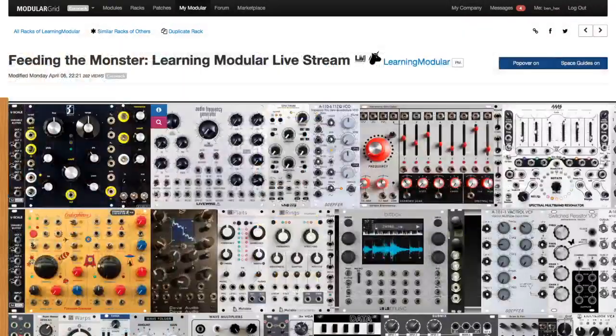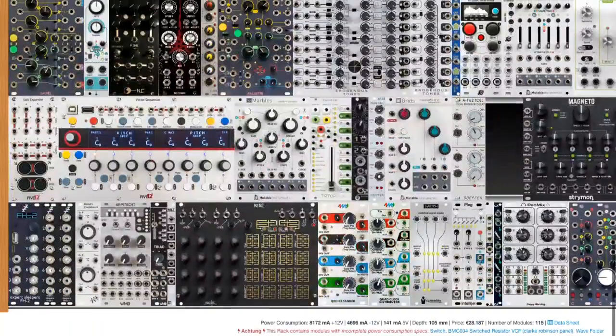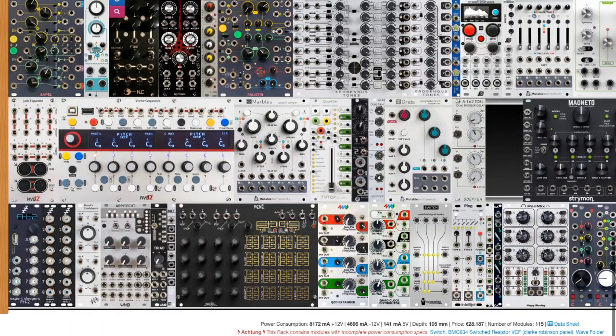I see Derek Daughtry, and again, the live chat is a bit out of sync from what we're actually seeing here. He brought up the thing about what the libs do, the low impedance bus boards. As part of my test, I found that just throwing capacitors onto a bus board does not eliminate noise. In some points, it creates a resonant filter that increases the noise. The logic behind the lib, he actually used transmission line theory based on server farms and the power for that to really see how to damp down all the noise.